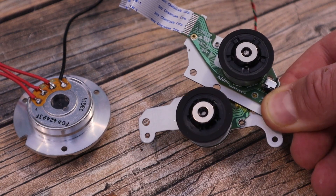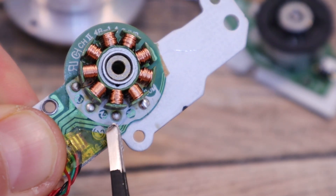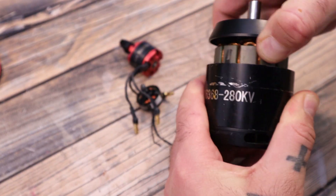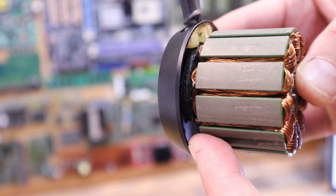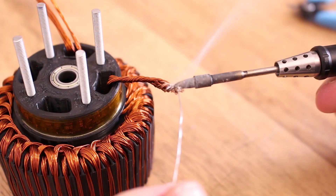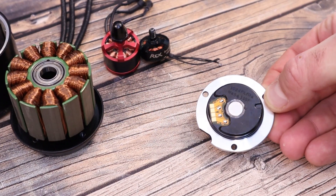These are brushless motors from DVD readers. If I open them, they also have 4 connections marked A1, A2, A3, and the common point. So what if your motor doesn't have a common connection? If your motor has a star configuration, it will definitely have a common point, but it might not be connected on the exterior. If you remember from my 3D-printed brushless motor video, I ended up with 3 phase connections and one wire with all connections merged — that is the common point. So why is this 4th connection so important for the half-bridge controller?